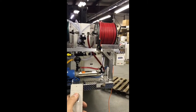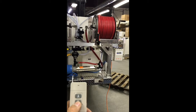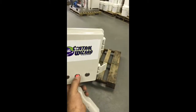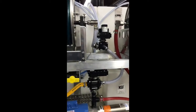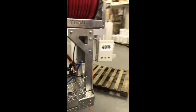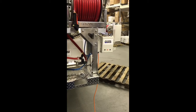So we can rinse on a moment's notice from a distance — just hit the button, boom, switch. And if you look to the right, you can see the lights changing on the control wizard. If I hit the B button, you'll see I turn the booster pump on — you can actually hear it — then booster pump off. The remote control will only work if the power is on, so if I turn the power off, I can hit these buttons all day long and it won't do anything. However, because it defaults to filling the tank and working from the proportioner, I can still continue to work if my battery goes dead. If you lose the remotes, you can still do it manually to switch your valves for priming. On for prime or rinse, off for drawing from the proportioner.